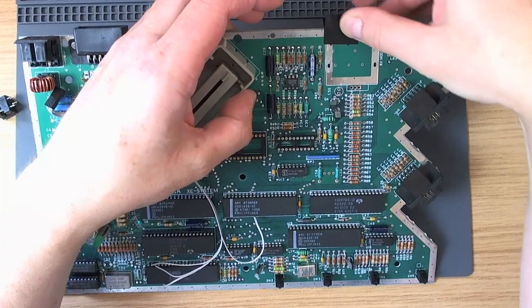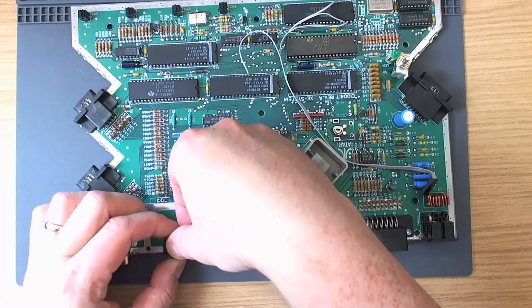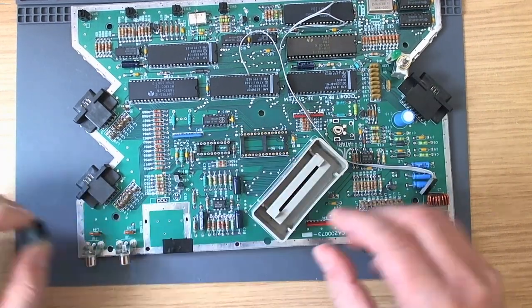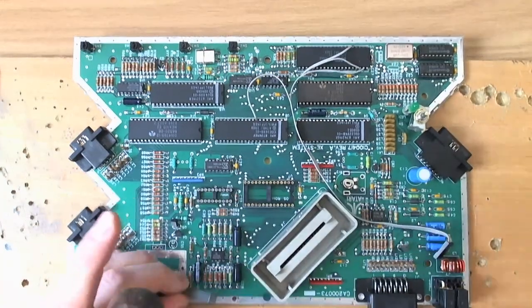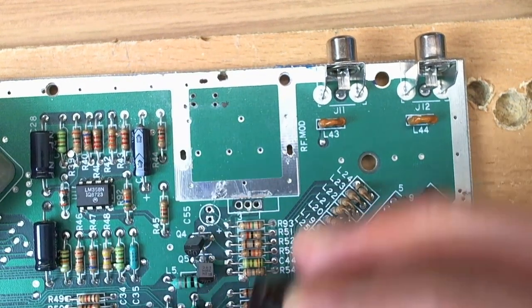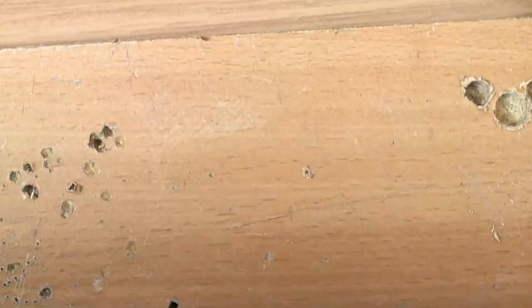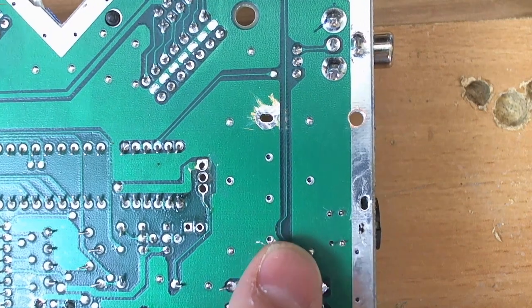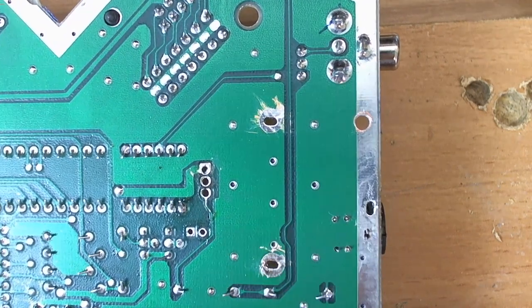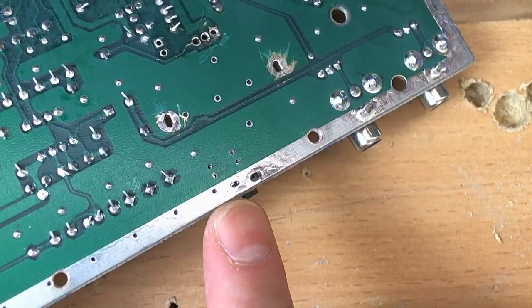I have to translate that array of pins and project it onto the board so I can drill holes in exactly the correct place. I'm going to use a couple of layers of tape — the idea being that if I just push this connector down onto the top of the tape, it's going to leave little pinpricks in the tape. That should do it. All right, there are our holes drilled and I think they've turned out pretty well. That matches perfectly to what we have on the back here, and the connector clicks into place.